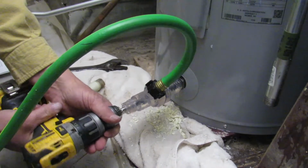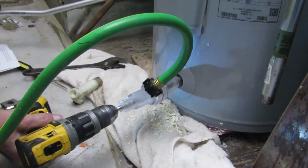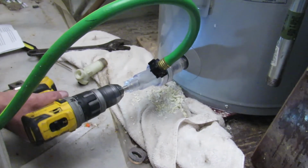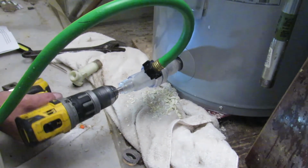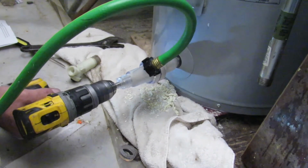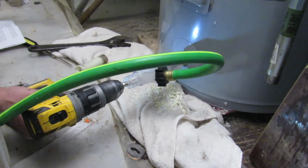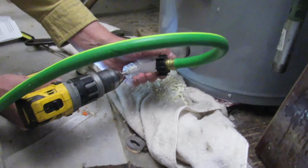At this point, attach a variable speed cordless drill to the end of the tank cleaner's axle shaft. Don't use a corded drill. Start by gently rocking the agitator back and forth to ensure it's not bound up. Increase the speed a little to move sediment faster.